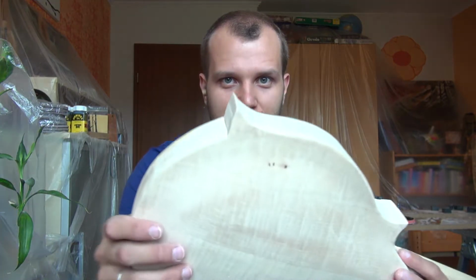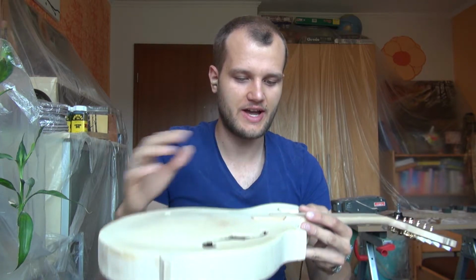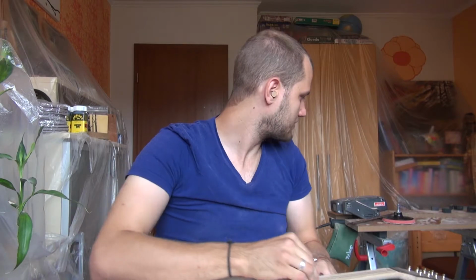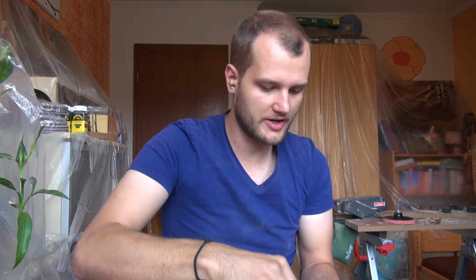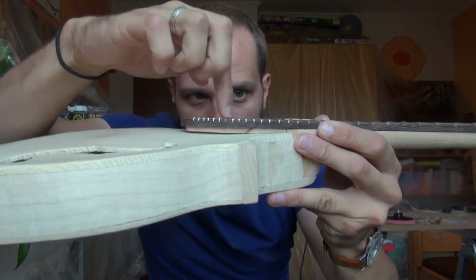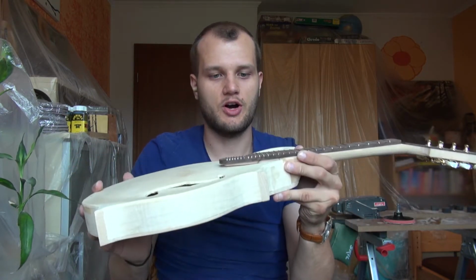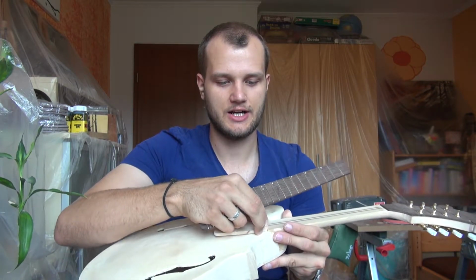And here I'm back with the first update. I now have two really nice corner points here with the wood. It's pretty smooth already, and I also have a fretboard extender, this thing right here. This is now going to help me when I attach the fretboard, so that when I'm putting my fingers on any of these frets beyond the 15th fret right here, I have a little bit of support, and I don't exert too much pressure on the fretboard at this specific point right here. So I'm now going to glue this on the mandolin, and if this is glued to the mandolin later, I'm able to put the fretboard on top, and then we're really close to the final product.